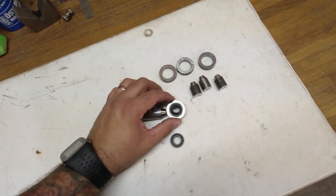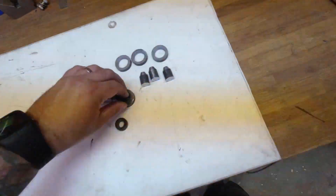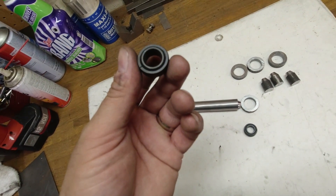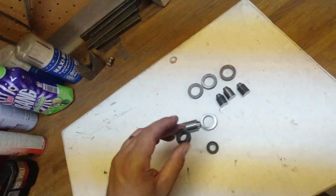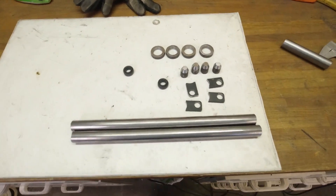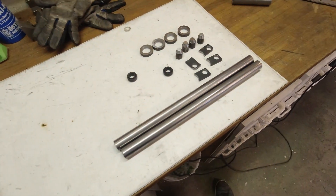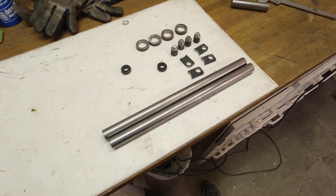It's just like a heim joint but you can't adjust it — a fixed heim joint. I'm from Sweden and bought these in Sweden, but in dollars they cost about three or four dollars, so it's a lot cheaper than heim joints. Now I've cut the pipes too, so they're ready for welding. As I usually do, I'll put them in my fixture table that I've taken from my CNC router. Let's start mounting them in the fixture.